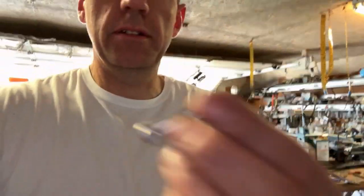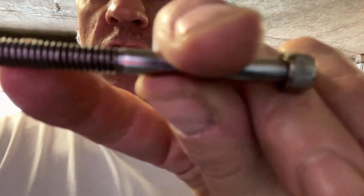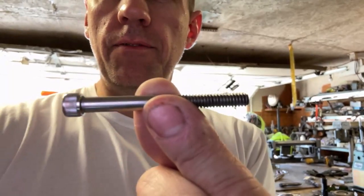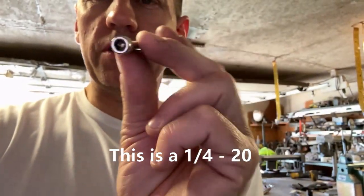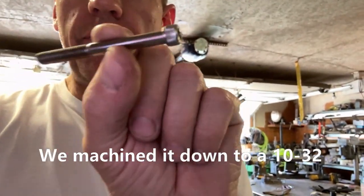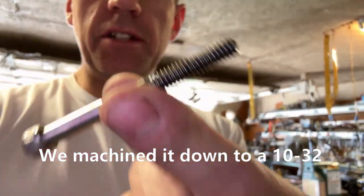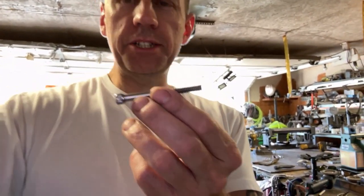I forgot to take video of it, but we ended up taking one of those bolts made out of that black metal, machined the threads off, and converted it to a 10-32 thread — the exact bolt he needed. Then we modified one that he had that was simply the wrong threads. So we did two different operations there at about two or three o'clock in the morning, but we got him down the road.